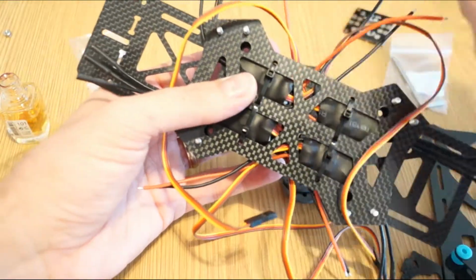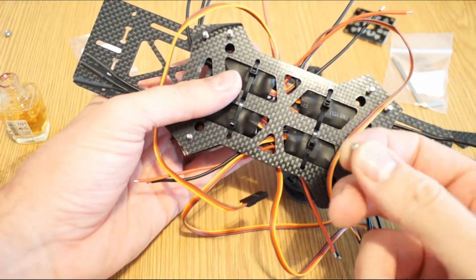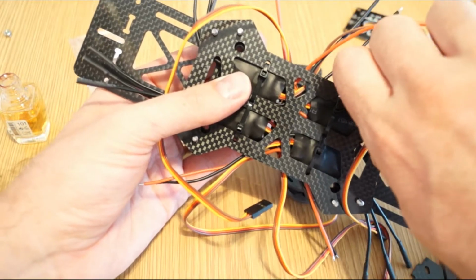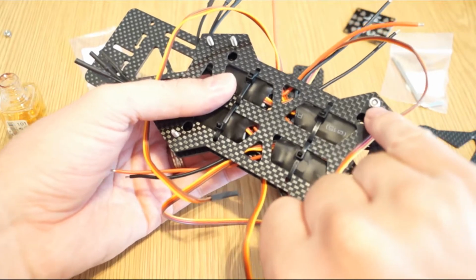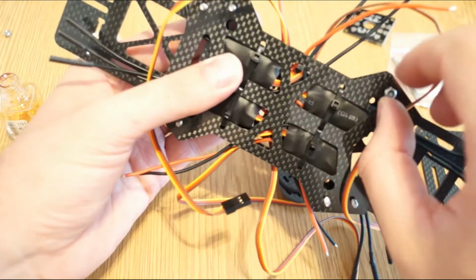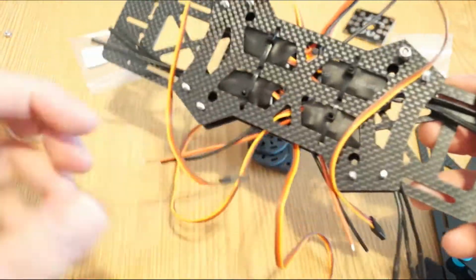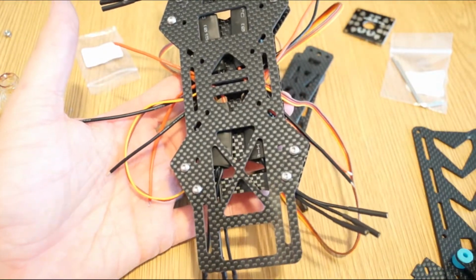Okay, it's really simple. After you arrange the wires, you should just use these provided screws that basically will hold in position, so they will not come loose. They will be tightened a bit heavier by hand. You need a lot of force because they have already a seal washer built in, so you need some pliers to hold it, or a normal key, and a hexagonal key on this other side. So basically you just use all 8 of them and your bottom part is assembled.